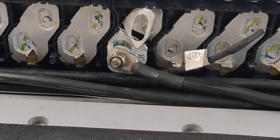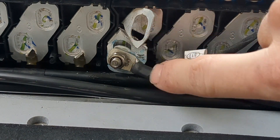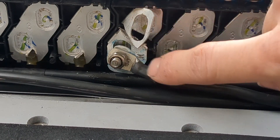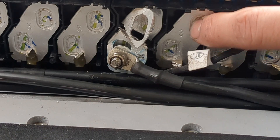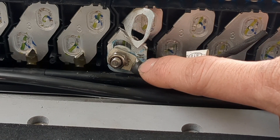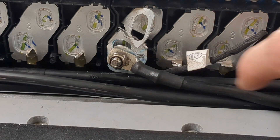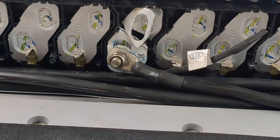Here's a close-up of what I've done at each of the cell bus bars that I've cut. After I cut the bus bar into two sections, I just folded the bus bar up and made use of this little eyelet section they've got at the top here, which is where they've come through to do their laser welding onto the actual cell terminals. Fold it up, cleaned it all up, bolted through a nut and bolt there with the eyelet on it that goes through the cable with a little bit of anti-oxidizing goop on there.